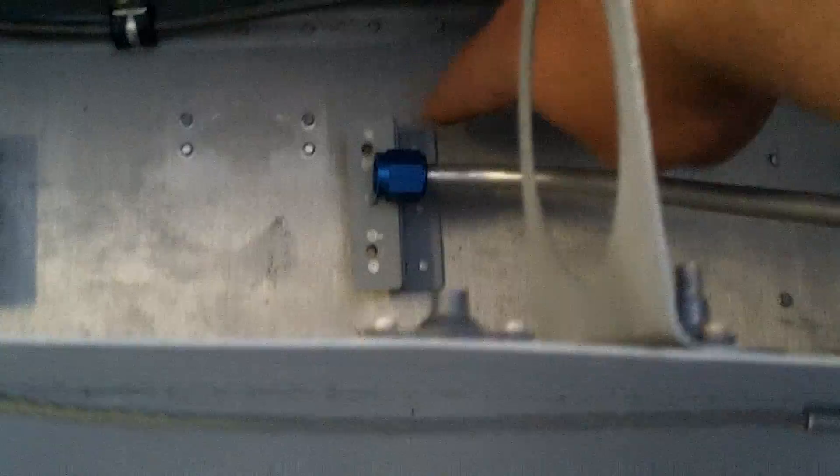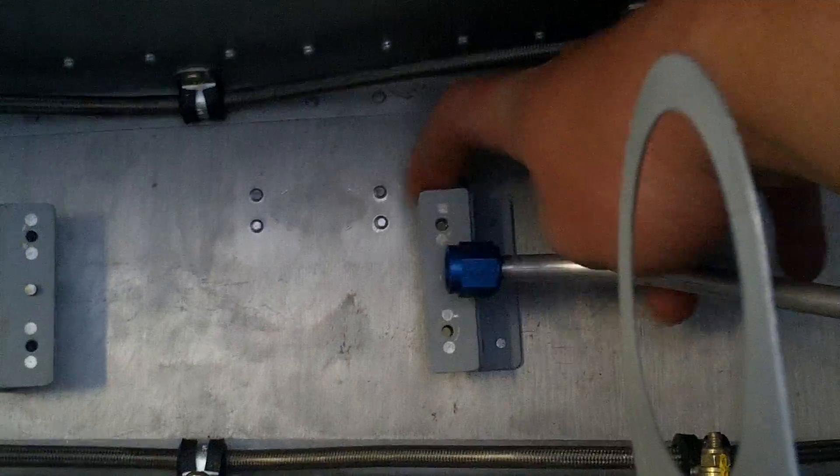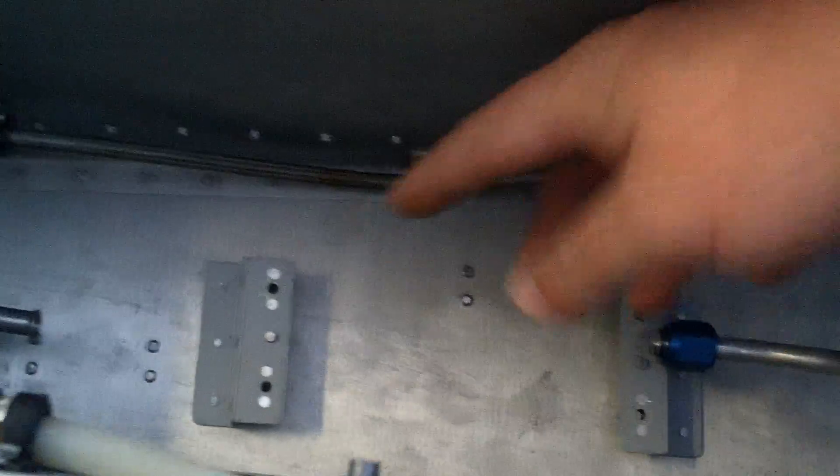To show you what the tunnel looks like, if you look into the tunnel coming forward to the firewall, you see this hard line. I've got a steel fitting up here, aluminum hard line all the way down to this mount, which is basically a set of opposing aluminum angles with nut plates underneath it. Same thing for the back — that is where the fuel pump and filter mount, and then you follow the aluminum hard lines back into the base of the Andair fuel valve and out to the wings.